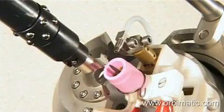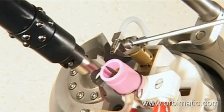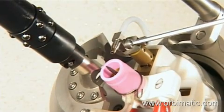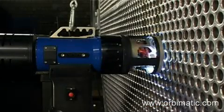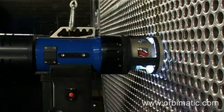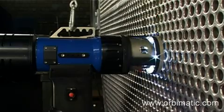The tungsten electrode distance can be corrected plus or minus 5mm during welding by a tubular ring. The torch and wire guide are easily adjustable by sliding carriages, and the wire guide can also be adjusted on a gear rack. Cooling water, gas, and power are transferred by a rotation coupling, which makes it possible to weld preheated tube sheets, because not only the torch but the whole weld head body is water-cooled.